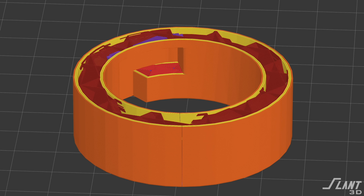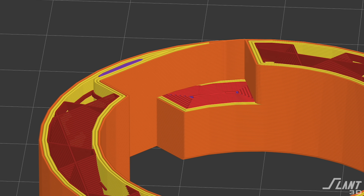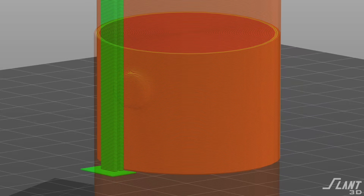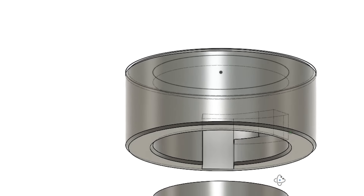The main thing to be aware of with this design is overhangs. That channel either needs to be less than two millimeters deep, especially if it's on a curved surface, or you need to have a chamfer at the top of that channel — otherwise you will have sag, especially on a curved surface where the first line down will basically try to pull across it. Ideally you would take the nub and the channel and make them pyramids of each other — a very angled channel. Make sure the nub has as much overhang protection as possible, otherwise you will have support going all the way from the base up to the nub, and you could still potentially have a failure mode where that nub sags. Make it as small as possible, make sure it is supported as much as possible, and ensure the channel itself has no horizontal overhangs in it anywhere.